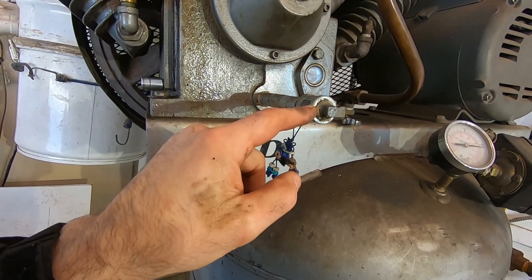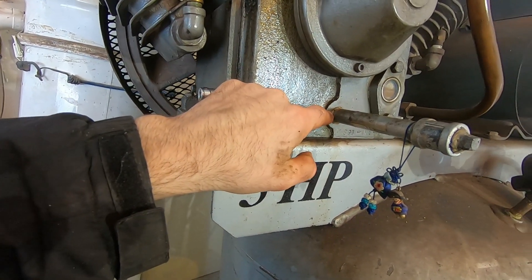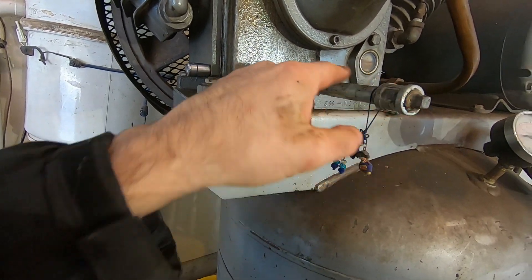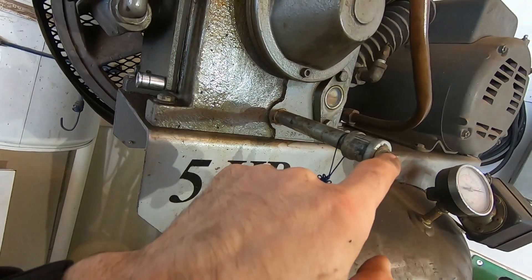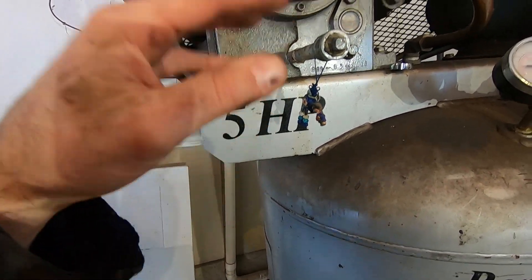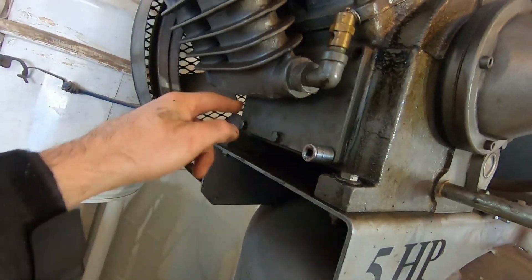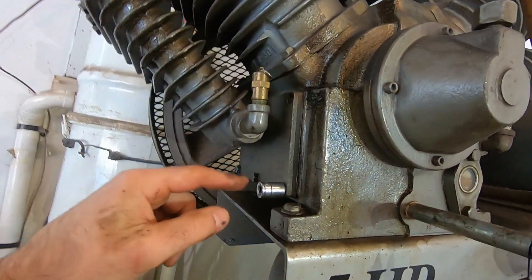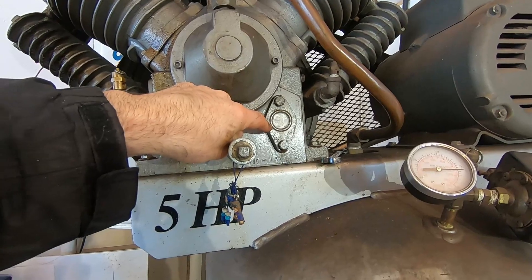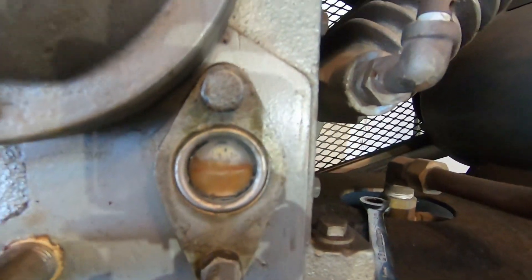There's a drain right here and we can use this to extract the majority of the oil. The drain plug used to be in the cast iron block but when I'd take it out, oil would drizzle everywhere and make a mess. So I extended it using a pipe nipple, a coupler, and a cap on the end — when I undo the cap, oil runs right out cleanly. We're going to drain it and then remove this side cover. The side cover has six bolts — I've already taken the hard-to-reach top ones off — and I'm also going to remove the sight glass level indicator because it's impossible to clean behind it.